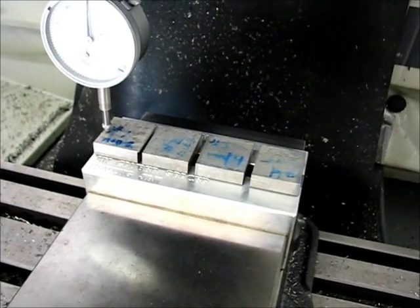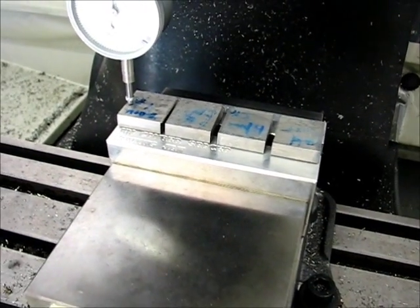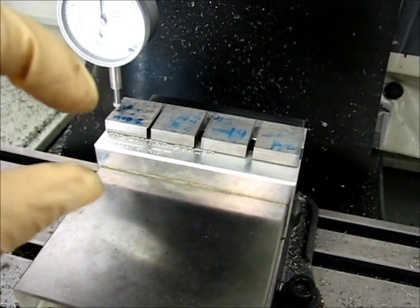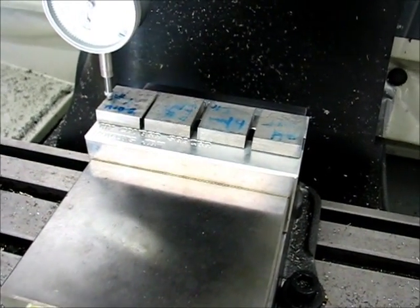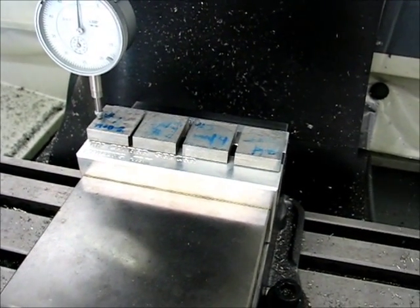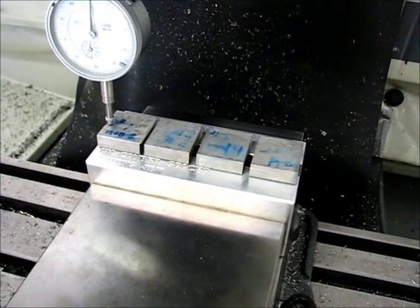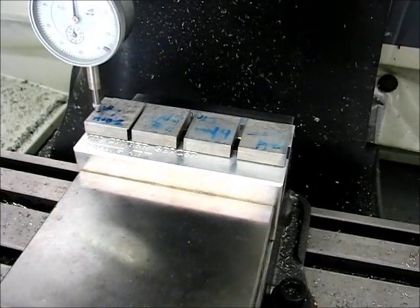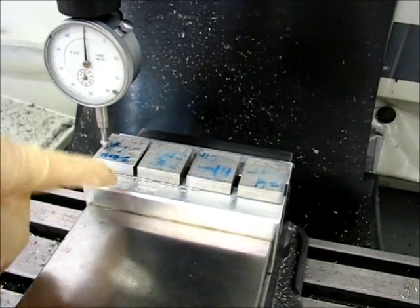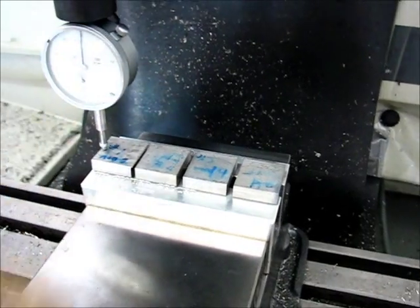One thing of note — the method I'm using right here does not account for differences in material thickness. I've made the assumption that after step one is done, the material is a certain thickness, which it is not exactly. So it's off a little bit, which means all of the following machining operations will also be off a little bit. I'm going to see how severe that is and see if I need to revise my method, such as touching off the top face of the jaw or the top face of the groove where the parts actually sit.